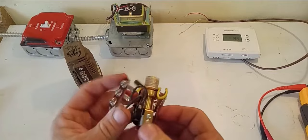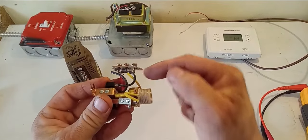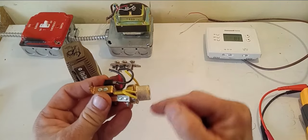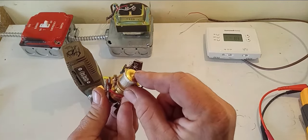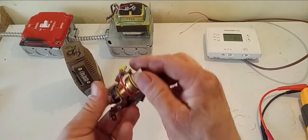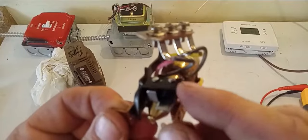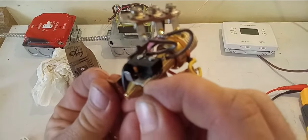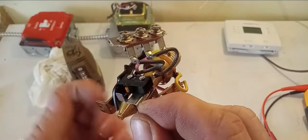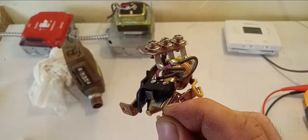So what is the purpose of this circuit? The answer is that it's a heating coil. As your current from 24 volts runs through this coil, it heats up the cylinder, and inside the cylinder there is a grease. When that grease heats up, it expands and pushes this plunger down. On the backside here, this is your end switch — when this coil heats up and pushes the plunger down, it comes up off that end switch and your boiler turns on. When the coil cools down, the plunger goes back up, pushes that switch in, and your boiler shuts off.